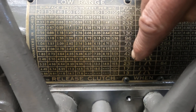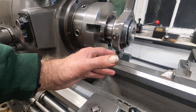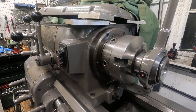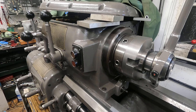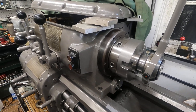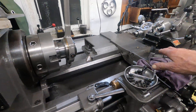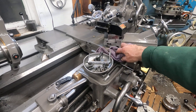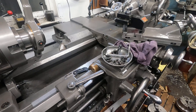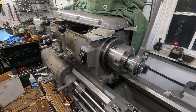It has enough power to break the machine and rip the headstock off — break these bolts. Like if something got caught in a chuck between the jaw and the way, it could bust the headstock off. They've been known to get caught in chains and rip themselves off the floor and climb up chains — that would be a pretty exciting thing to see. These machines that have all this heavy gear and stuff can bust the components off, like the top slide. So you really got to be careful not to crash a machine like this — you got to be very careful.